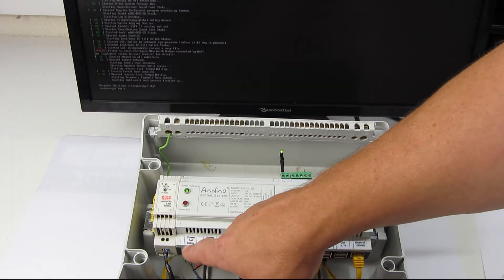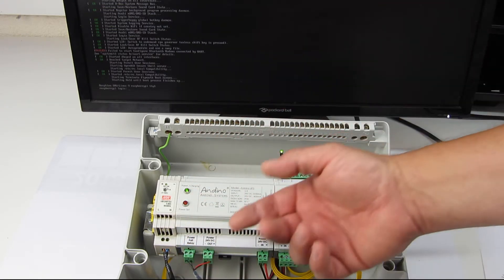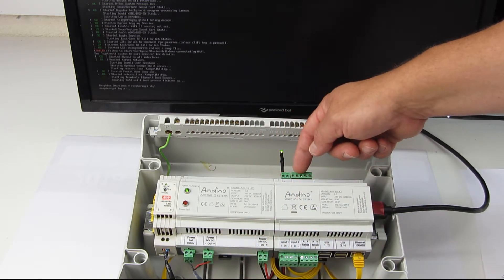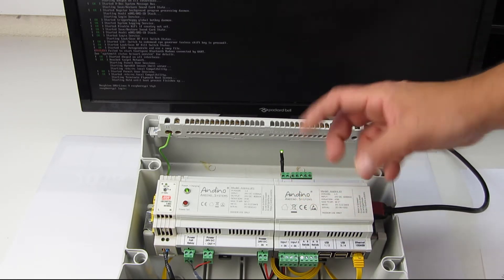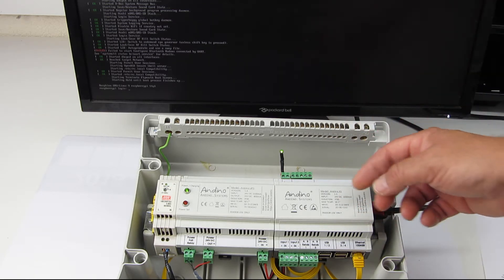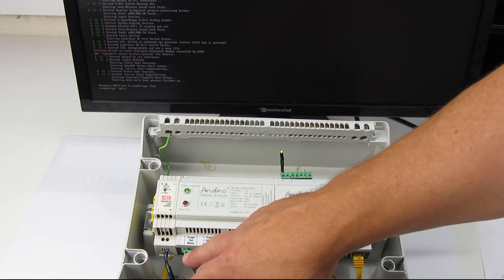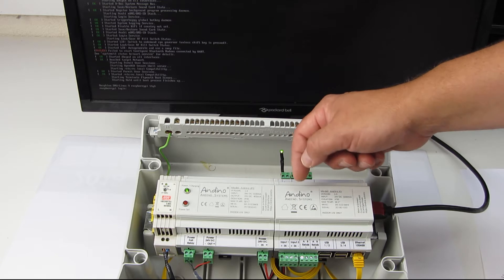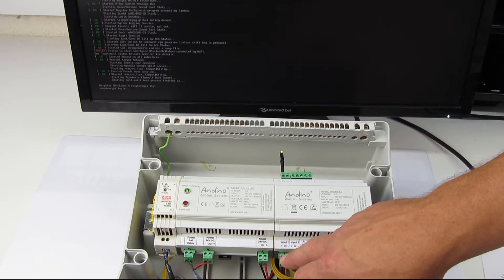Back to the wiring. We have a power fail signal — this is a relay output. It's potential-free, a completely isolated contact. Internally I switch this input toward GPIO. In the Raspberry Pi we have a little Python script that checks this pin and shuts down if the contact goes open. Because we have a potential-free contact and a very short line, we can connect this directly to the GPIO. But you can also use an isolated input for this.